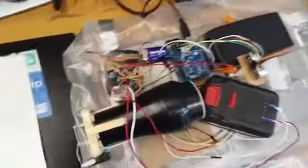In order to actuate these relays, because their coils would take much more amperage than the Arduino can provide, there's a couple of circuits in there using BJTs according to this schematic, and a 9-volt battery to supply that current to those relays. Then also to avoid overloading any pins, since my servo is actually moving something with some resistance, I have it powered by an external power supply, a battery bank right here. You have to wake that up for it to go, which is why you did not hear those in my processing video, although normally it doesn't go to sleep because it's powering the Arduino.